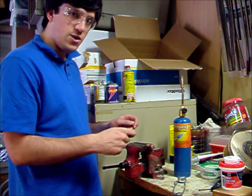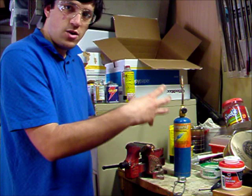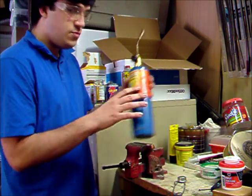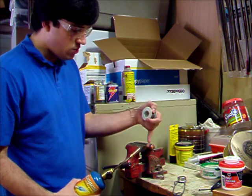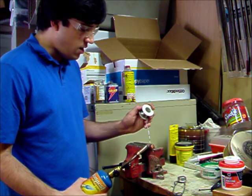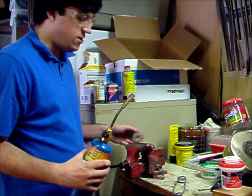It's not that you're going to put solder everywhere on it and then try to get it together. What it really is, is that you put it together, you apply heat, and then you just come in and touch it right on the joint between the fitting and the tubing, and the solder will literally just suck into the whole thing.